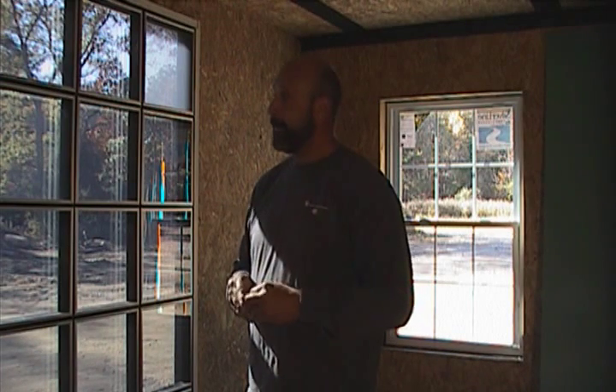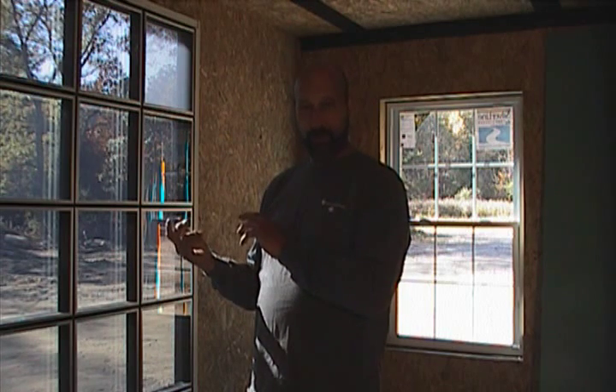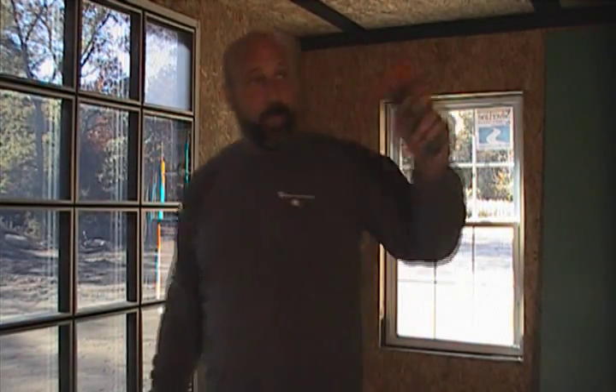October 24th, we had a great sunny day. Very cold last night — this morning we came in, it was 23 degrees outside. This window system went down to 58 degrees — the water temperature in the window — which is the coldest we've experienced yet. We have no other heating system installed in the house yet, and we still haven't completely insulated and sealed around the windows. So what I want to show you is our room temperature in the house with no heat on is 58 degrees.